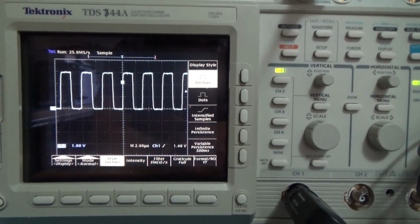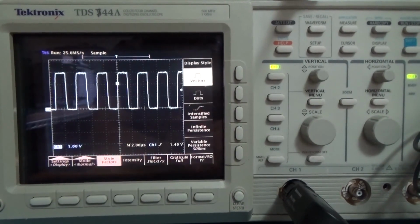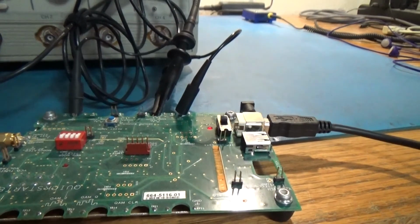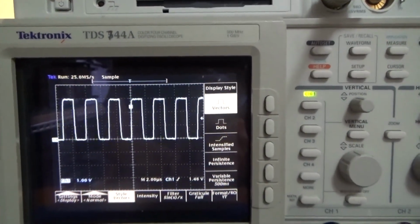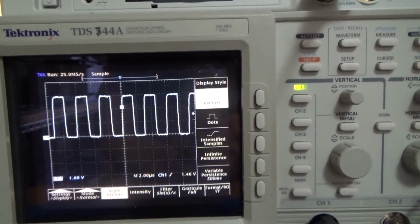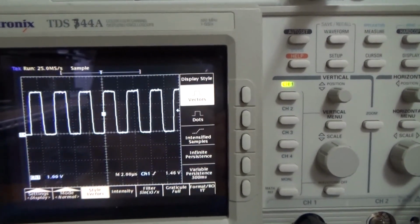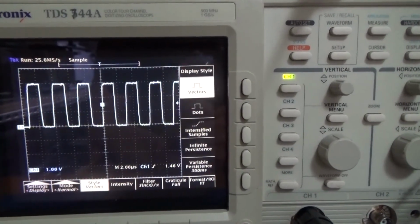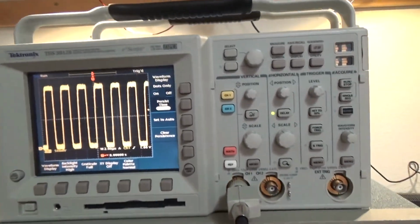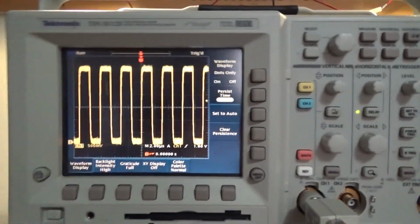the glitches that are occurring are just invisible, so you think that your signal's okay, and really, if you've got a signal that's designed to be horrible like this one is, but not very typical to be seen, you can think you have an okay signal. And so again, if you're in this kind of mode on this kind of scope, you can be there for an hour or two before you actually see a glitch. It depends on how often the glitch is occurring, of course.